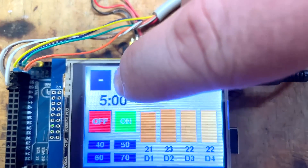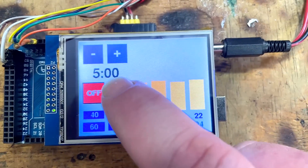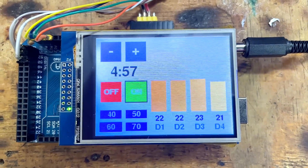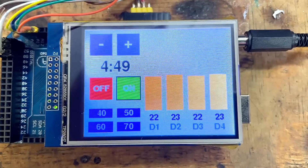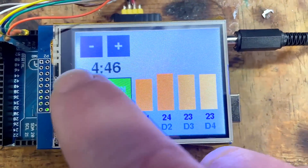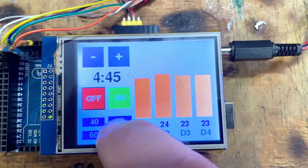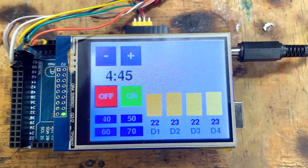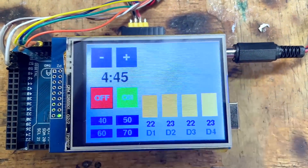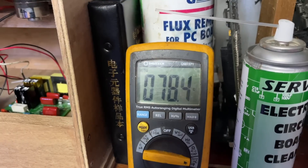I also built in a countdown timer — I can set the time using the plus and minus buttons. One thing really annoying about the analog timer was there was no way to overwrite it once it was counting down, but the digital controls allow me to switch off the cleaner at any time. I also have four buttons at the bottom to set the shutdown threshold: 40, 50, 60, and 70 degrees Celsius. With the new cooling in place and the faulty transducers removed, the drivers generally sit around 35 degrees C when operating, so I typically set the threshold to 50 degrees C. When I consider I was getting temps running away near 80 degrees Celsius from these same drivers before, I do consider the stability of the cleaner greatly improved.